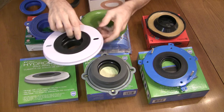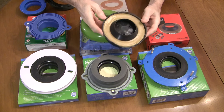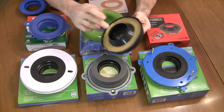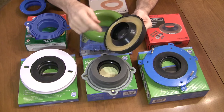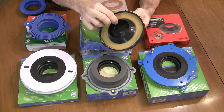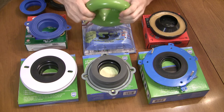It's too bad because those products would really fix my out-of-level problem — my tile floor is level so they'd cure the out-of-level flange. This other option is just a reinforced wax ring — it's a little taller than a regular one and has a horn on the bottom at two and a half inches. I could trim that down to make it a bigger opening, but I'm trying to avoid wax. Also, a lot of old-school plumbers hate those horns on the bottom of wax rings.